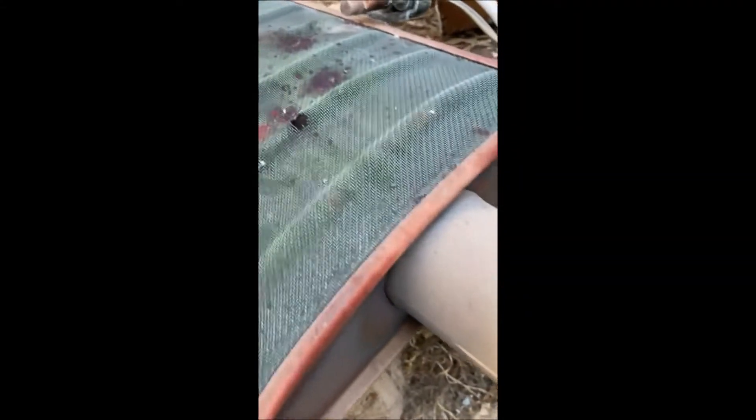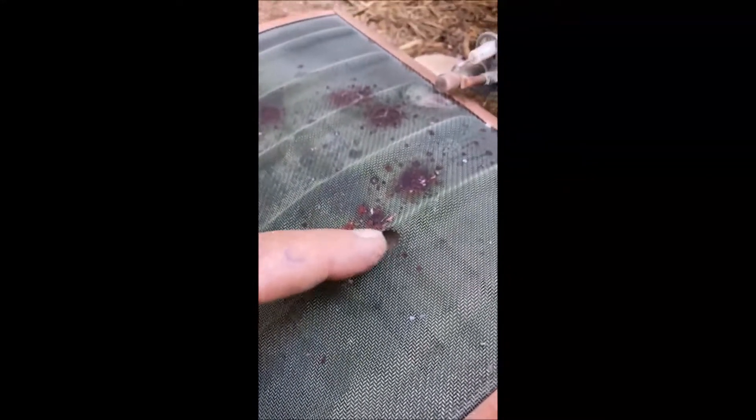This one has a hole in it — you see that hole right there? There's a hole in the mesh. Sometimes water condensation will drip down on these things and over time starts to chew away — you can see some of the water marks. Or somebody pulled the burner assembly out and ripped it. Because the mesh has a hole in it, that's what causes this crazy situation.